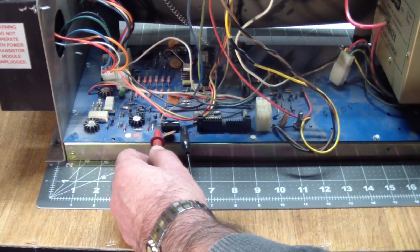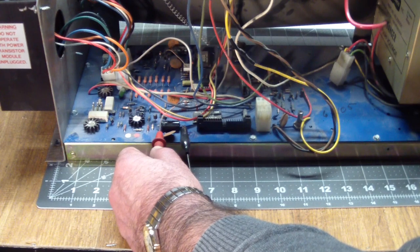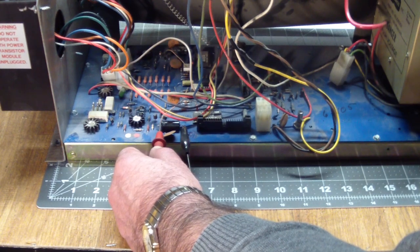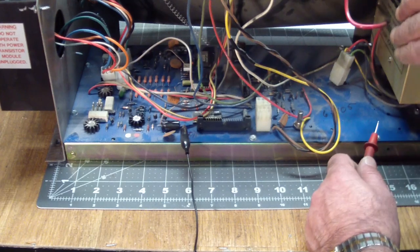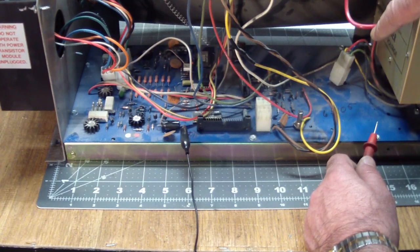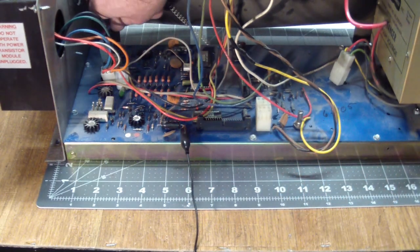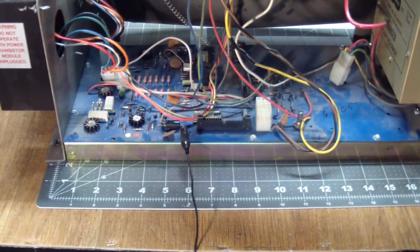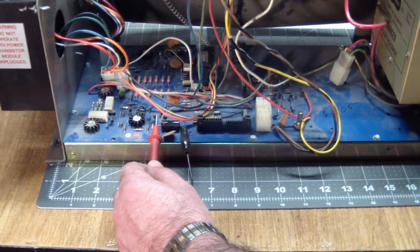So with the high voltage plugged in, we measure it again, and we are still in the kilo ohms. Phew, it's not this. Well, we don't know if it works, but the short is not in here. We then plug in one of the transistor pairs and measure again.